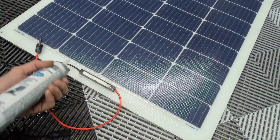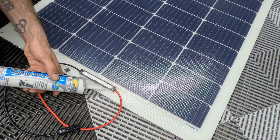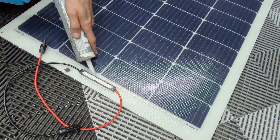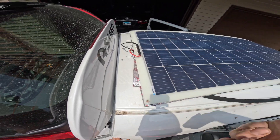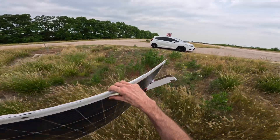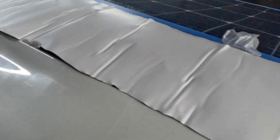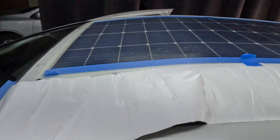Now I just had to reapply some silicone back into the junction box and go around the base too, just to be safe. I snapped the cover back onto the junction box and we have a fully restored flexible solar panel. I think this solar panel takes the wind and durability test — I just wish I could say the same for their customer service. Stay tuned as we try reinstalling this panel and cross the border into Canada.